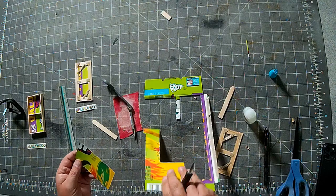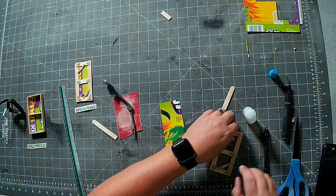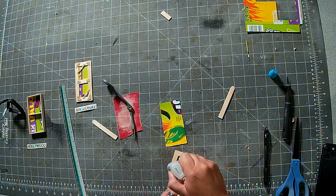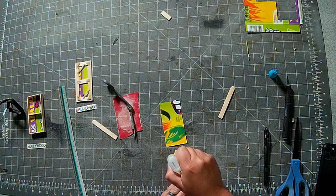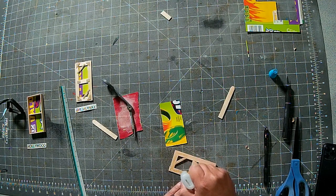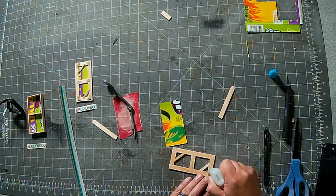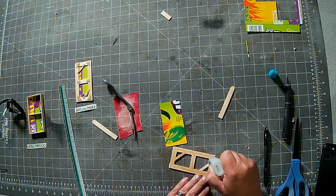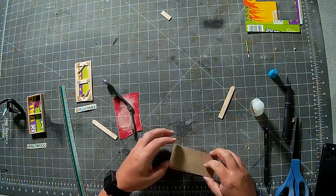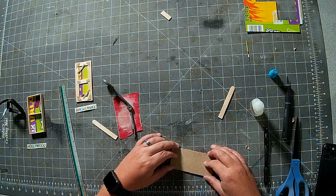Okay, now that I have my cover cut out, I'm going to apply it to the flat. In the normal case, this would be stapled on. If it's muslin or a fabric, it's stapled along the outside edges. If it's dimensional lumber, like a piece of plywood or some hardboard, it gets stapled and glued to the top.